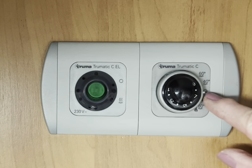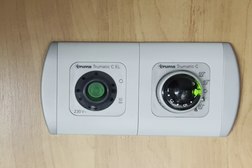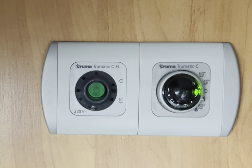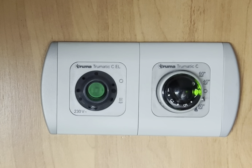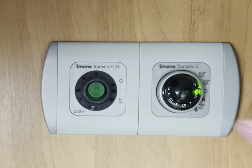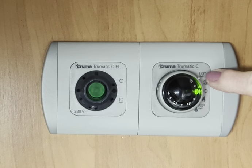In this position, it's in the off position. One click down to the symbol of the flame and you have central heating only. Second click, water symbol and flame is hot water and central heating. If you just want hot water, turn the dial up to the top.